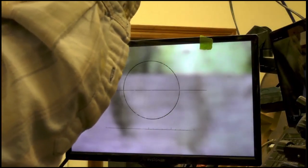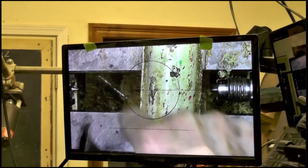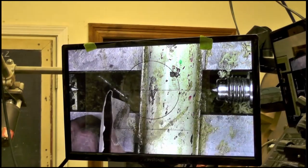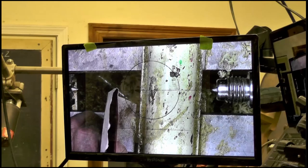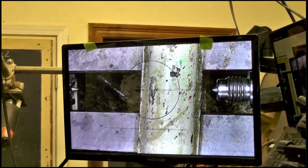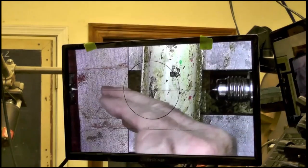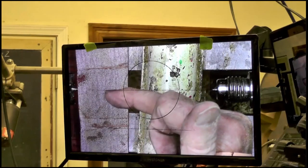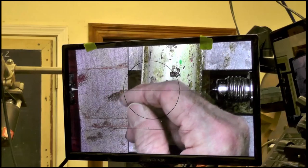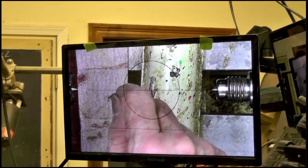When I change the zoom, it changes because my camera is not set at a dead 90-degree angle straight up off of the lathe. If it was 90 degrees, you could put the marker on there so that the next time you put that sheet on there, it will come out exactly where it belongs. If it was perfectly aligned and I dropped a plumb bob from the center of the focus down to it and aligned it that way, when I zoom in and out it wouldn't move. If it was 90 degrees up and down, you wouldn't have to worry about the center line moving.